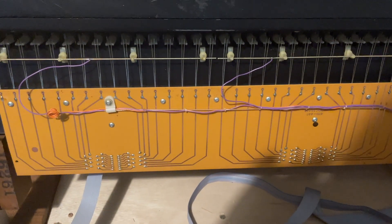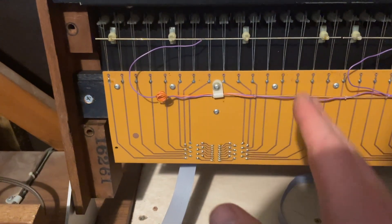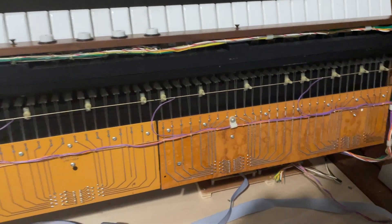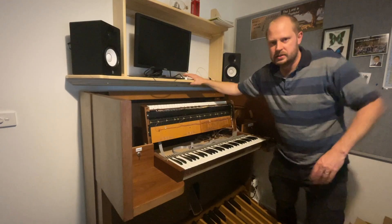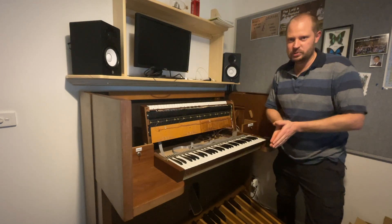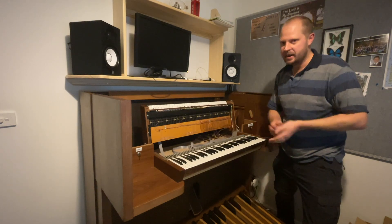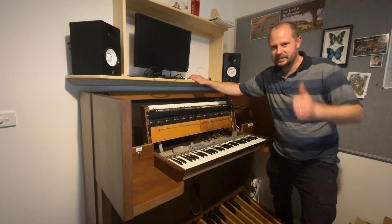When you're looking at your organ, you need to examine the circuits and circuit diagrams to see where the wires go, so you can determine what matrix arrangement you have — whether it's a 16-by-4 or an 8-by-4 or whatever it might be. That's all I've got time for today. We need to get into more details about the matrix arrangement, especially the introduction of diodes and how the actual inputs and outputs of microcontrollers work, but I'll cover that in a future video. Thanks for watching — if you have any questions please leave them in the comments.